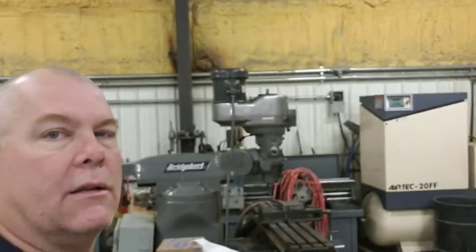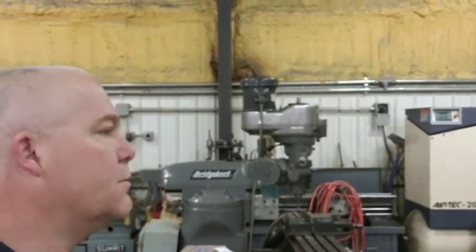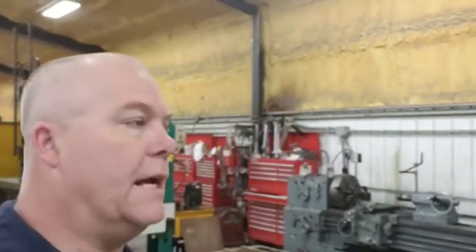And although you can do a lot of stuff with CNCs, there is definitely a place, especially in our business, for manuals. We do still keep some manual machines. We've got a couple of manual lathes. We've got a bigger one, that one's like 3.5-inch through bore, and then a little baby one hiding back behind our little Bridgeport here. They come in really handy with the type of work we do. A lot of times we're doing a repair on something or repairing a bad journal or something. It makes no sense to put that in a CNC.